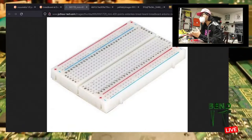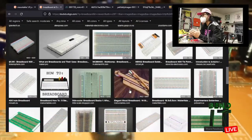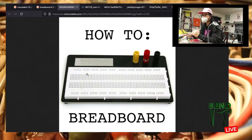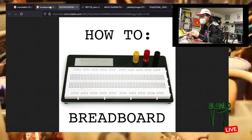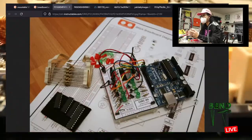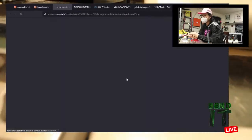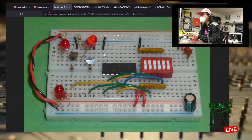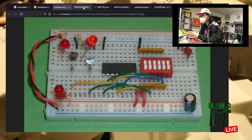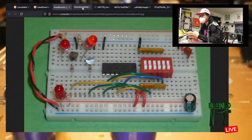And from there, that's actually not the most efficient form. If you're building a lot of those, then you may want to simplify those traces because a whole grid of rows may not be the most efficient way. So then you can simplify them into those crazy snake-like traces. They look that way because now the circuit diagram has been condensed into its most efficient form. And that would be a PCB, a printed circuit board. So you first do your prototyping by translating the circuit diagram onto a breadboard, and then from there, you can streamline it even more into a PCB.